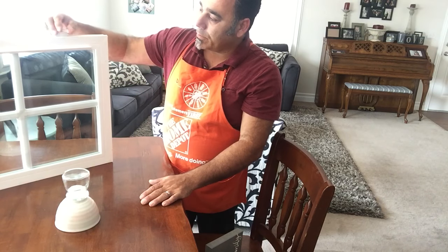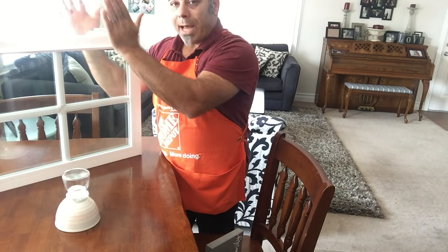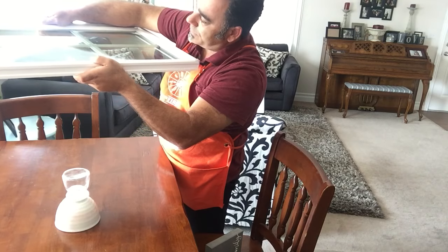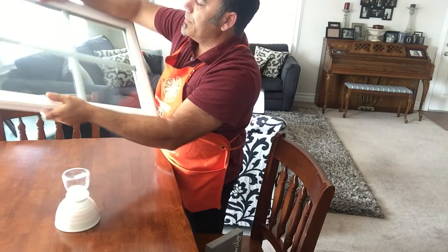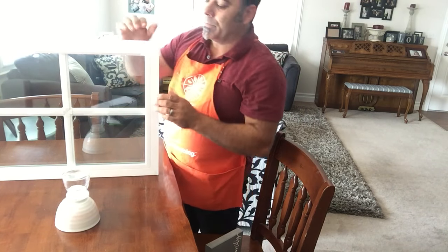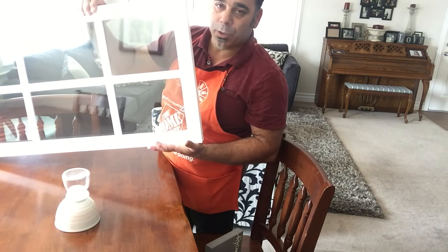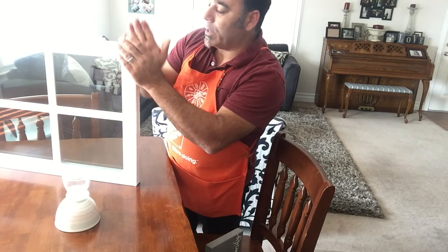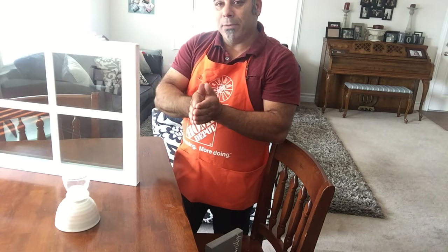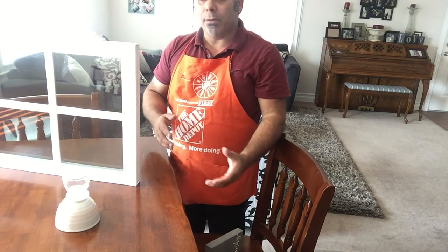As you can see right here, it's got dual cam locks. When you've got the meeting rail right here in the middle and it meets with the other sash, you get a very tight seal. Not only does that pull the two sashes together, but if you look at the weather stripping on this side and this H channel — it's got a U-shaped channel on the stationary panel, and the inner lock, they kind of come together to create an even better seal. It's got bubble weather stripping and additional flanges right here, so it seals real nicely to the opening and all the way along the framing. What that means to you, Mr. Jones, is that whistling wind you had in your bedroom from those wood windows — you're not going to have that any longer. It's going to be airtight, keeping the cool air in and the hot air out.